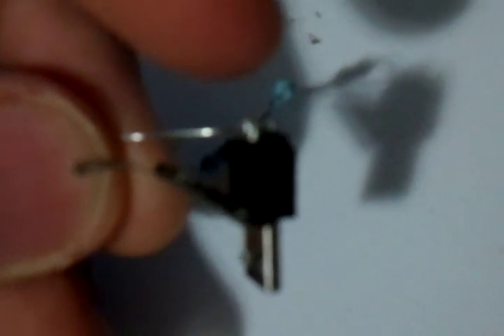I tried to open up this side — this part slides out — and you can see pins 1, 2, 3, and 5. Pin 4 isn't connected to the USB cable. It's a flat pin, so from the front — from the mouth — it looks the same as the others, but on the back side it's only a flat pin.